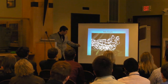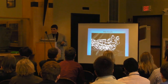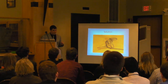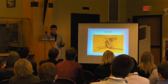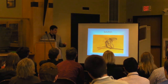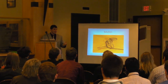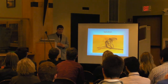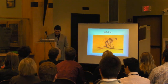I originally was opting for something like this, but that takes a lot more skill at welding than I currently have — this one is a little lumpy around the welds. So this was my solution, and this is a picture from a few days ago. I actually had to make quite a few modifications to how it's going to close, because the cable I was using was way too thick. This one is about 0.9 millimeters and that one was 1.6, which provides a lot more resistance trying to go around tight corners. I was actually told by Mr. Loney, who designs his own prosthetics, that I was going in the exact right direction using bicycle cable. I obtained this much thinner bicycle cable from him, and he just gave me a nice bag of tricks from walking around his shop.